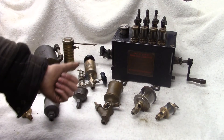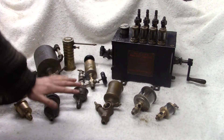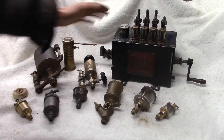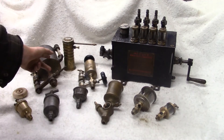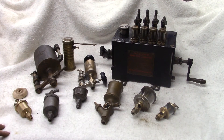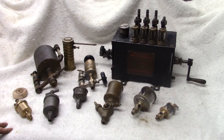So the two very basic types of lubrication we have on engines are oil lubrication and grease lubrication. Most of what we have here are oilers, then we have three grease cups over here. On the oil side of things, which is seen a lot more, there's force feed lubrication, drip feed lubrication — which is all these — oil bath lubrication, which I just mentioned with my Bovard and Seafang, and then there are also a couple of other styles of oiling I'll show you, for example chain oilers, plain oil holes, and what I'd call oil packing.